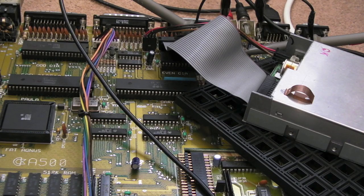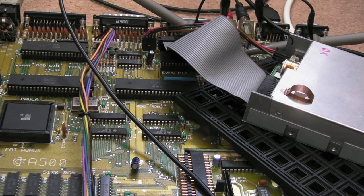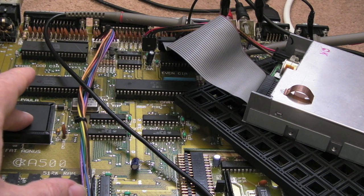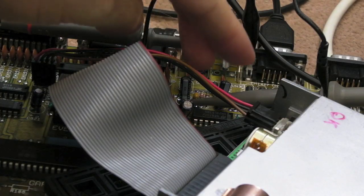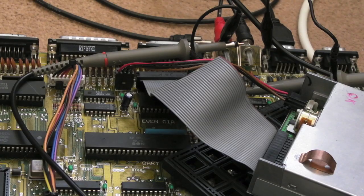So just wrapping this video up — I would say it's super minor, really not worth worrying about. It's a question of whether you want to swap those caps or not, but I'm pretty sure you'll be all right if you don't. I see nothing wrong with the bipolar caps in terms of the quality of the audio that goes through — they sound perfect, and the signals look just the same when they go through polarized caps on my scope. It's just an optional thing. This is a Rev 5 board, by the way — there might be another repair video coming up soon, because there's a few more 500 boards to come. This one's got standard electrolytic polarized caps, not bipolars. If you've not already checked out Jan's channel, check it out — I'll post a link to his video and my previous video. Thank you very much to everybody who's commented, and hopefully there'll be some more comments and suggestions. Thanks for watching — I'll catch you soon.